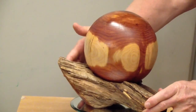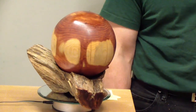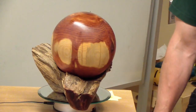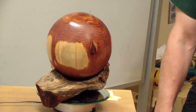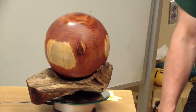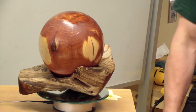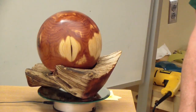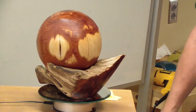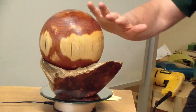We have another artistic piece — gorgeous, nice shape. The tannin inside the cedar has ruined the acrylic. I didn't seal it before I put the acrylic shine on it, so you can see the acrylic just disappears. I made this top at the same time, then made the base separately — that was at Bill Wallace's workshop. I just took that piece of cedar. I really like the way that one looks — it's neat how it sits down in there. What can you do about the finish now? Sand it down and redo it.